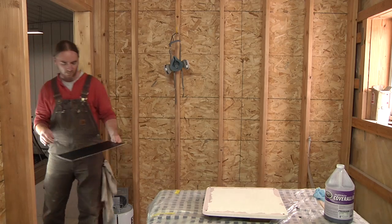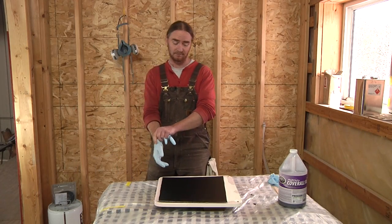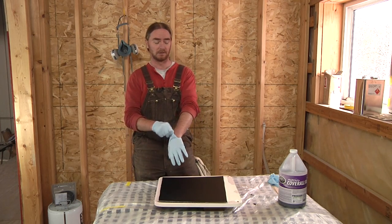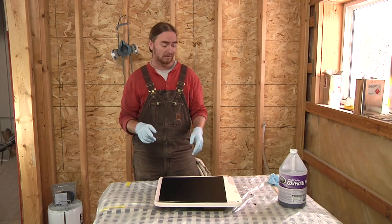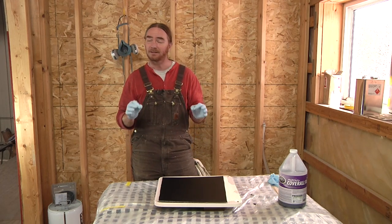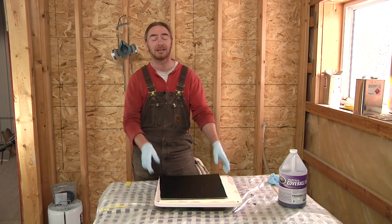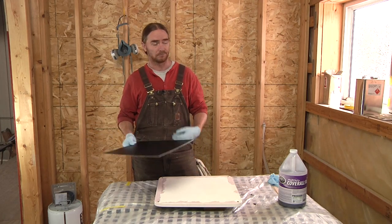This turned out beautiful. Do you know what you really got here? Anyone ever hear of the Gibco Flex Mold? You know, the stuff that they sell you for 50 bucks a square foot to repair a small little area of non-skid on your deck? Same thing — exact same thing. The stuff that you buy from them is flexible and they're able to put it up into a roll, but it doesn't matter. This does not cost you 50 dollars a square foot to make, and you can make these panels as large as you want. You can hold on to this and use it over and over again, indefinitely.